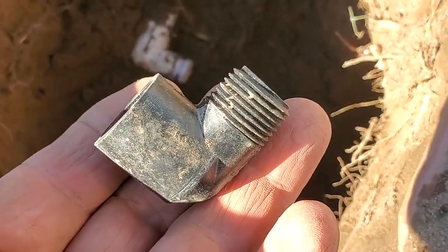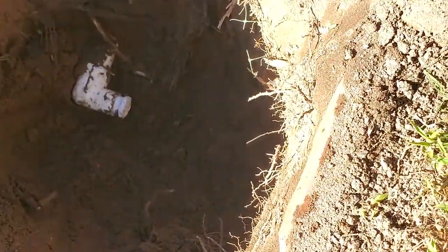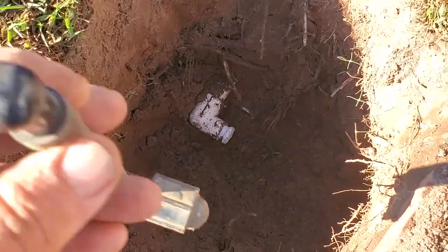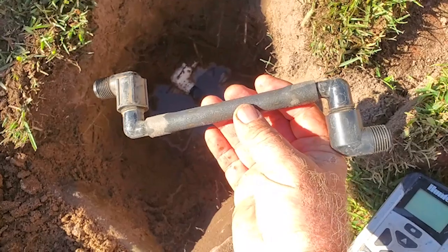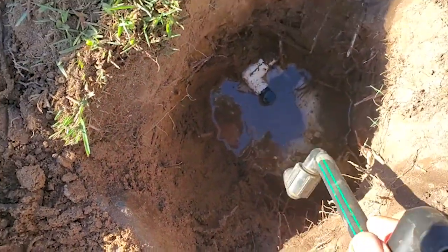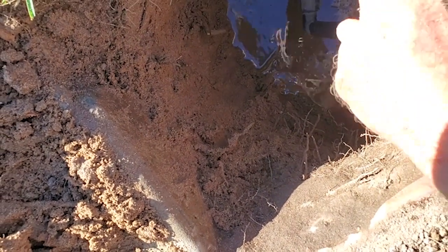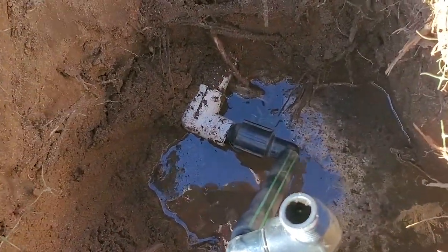So I'm going to put this on, and then I'll leave it in this position where it's straight up. And then all I have to do is screw it on this way into that fitting. So I'll show you. Okay, I've added a Marlex. So I've got a Marlex at either end. And then I can just screw this on vertically. Okay, now it's ready for me to screw the pop-up on.